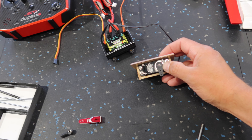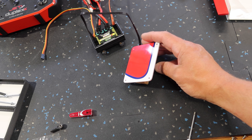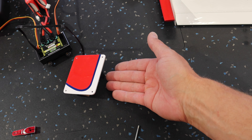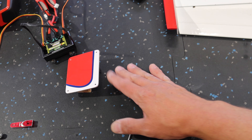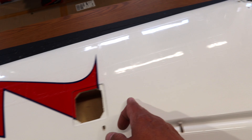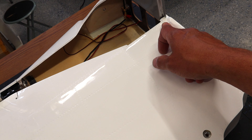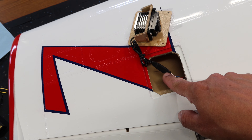We've got our servo wall set up, we've used the rubbers, and our arm is installed. This is kind of a temporary thing because we don't know what kind of resolution we're getting or what servo arm length we need. The servo has been centered and is moving the correct way. We need to create our servo extension coming to just above the wing tube.